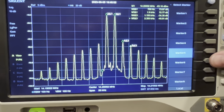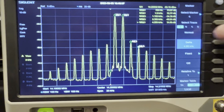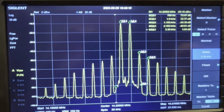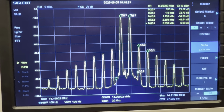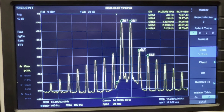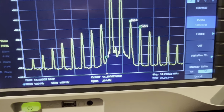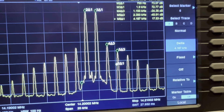For tones, I generated two ultra pure tones at 700 Hz and 1900 Hz using Adobe Audition. If you zoom in on the tones, you'll see the intermixing of the two tones. They're playing right now, coming out USB into the USB input of the radio. The radio stays in the digital domain — digital audio all the way to the digital-to-analog converter before being fed into the RF section. So it's about as clean and pure as you're going to get, not introducing any distortion products from mic preamplifier circuits or anything else.